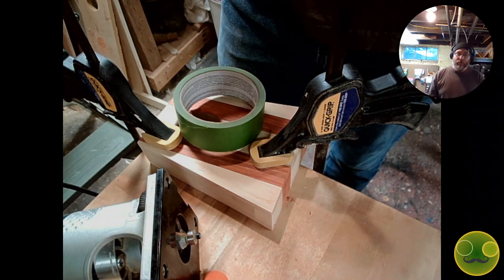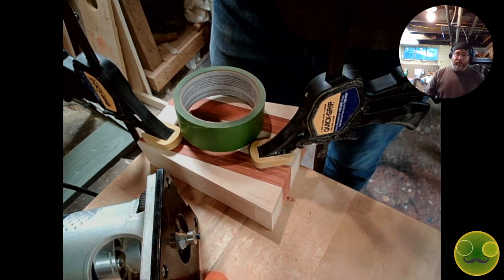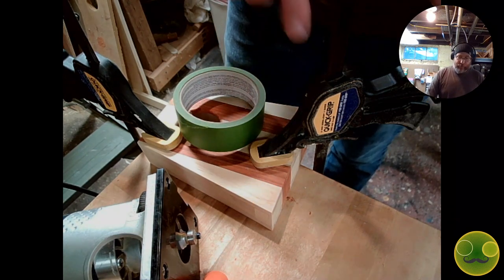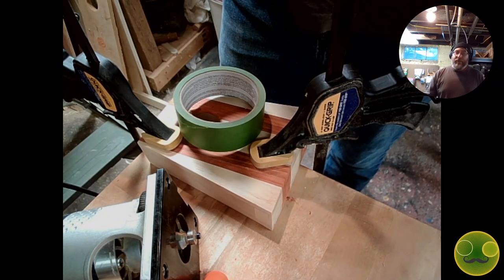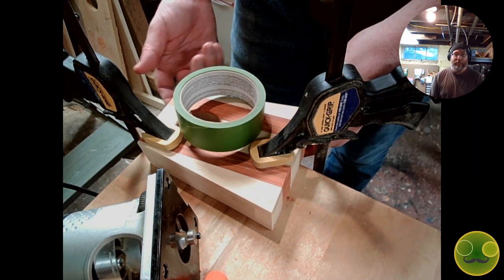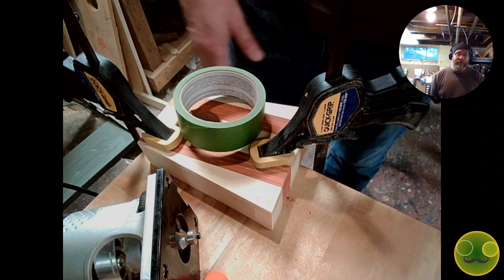Once the frame was all glued together, so I did it all at once, I did some sanding on those pieces to get rid of the excess glue and make sure everything was flat. Then I put some glue around the outside of it, stuck the top and the bottom on, and clamped the faces very tightly with basically all of my clamps. So the face plate and the back plate were glued on, and then I let it sit overnight.